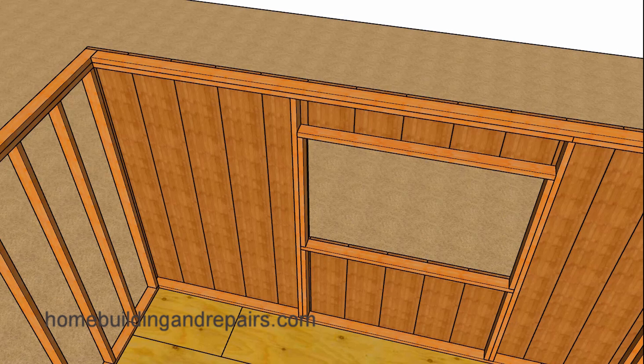So the moral to this video is simple. If you're going to use 1 by 12 vertical siding and you're not going to install any insulation or anything else that will require additional framing studs, then we might be able to get away with larger on-center stud spacing — especially when building smaller homes, tiny homes, or even sheds.